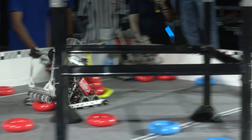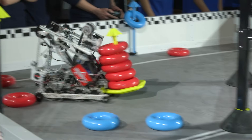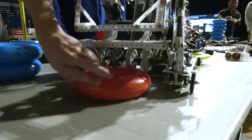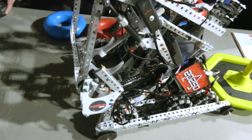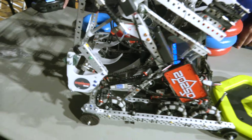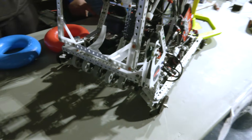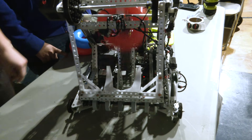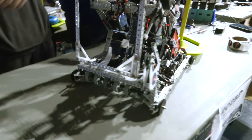Josh, let's dive right into this robot. Talk to me about how your intake works — we'll follow that ring journey through your robot. So our intake is slightly different from other teams. In previous iterations, our intakes had a bar running through here; as the ring would go up and into it, it would hit the metal causing issues and rings would get stuck. So we developed a design where our intake hooks fly through the ramp, allowing the smoothest pickup with no hiccups, so we can easily pick up multiple rings at once and not worry about jamming or causing issues in Auton.